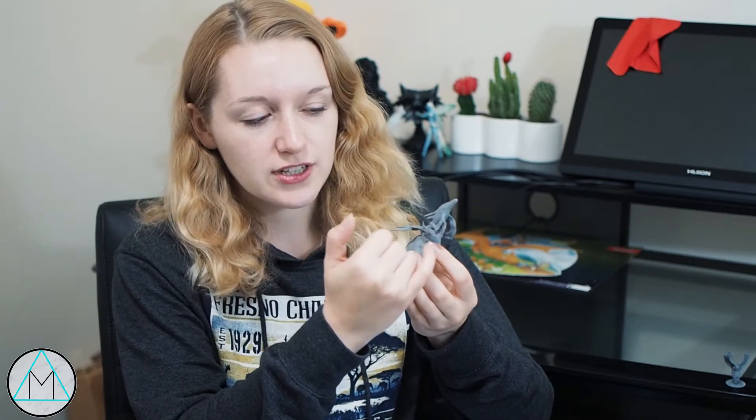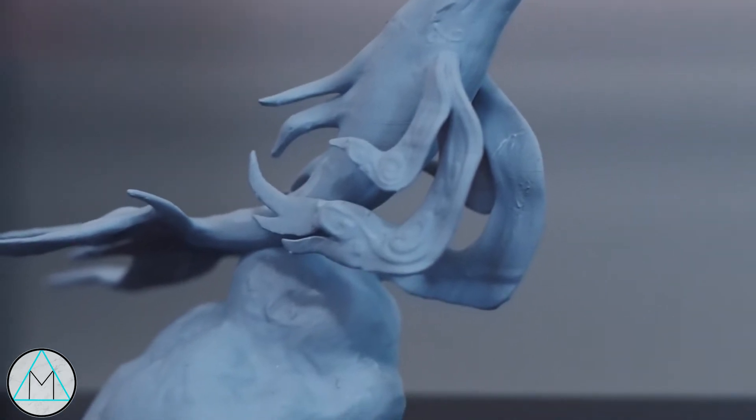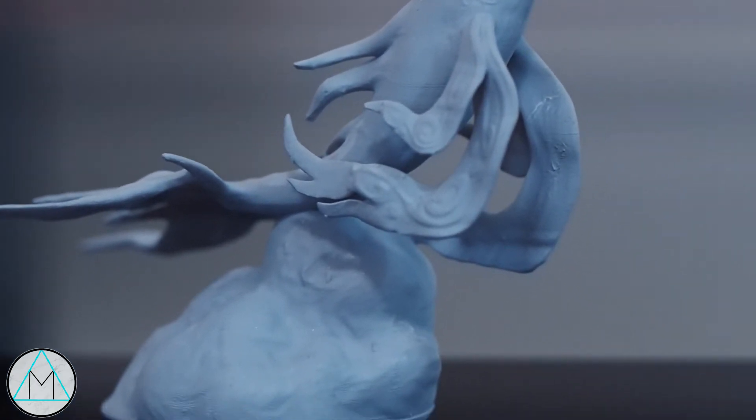It's still pretty challenging though. I try to have the ends of the wing going upwards because it conveys the design of flying and upward motion, but at the same time it's easier to 3D print. Most things I design, I consider printing with the base flat. I've printed stuff at 45 degrees before — it's just not my favorite. I usually have to sand the base and get rid of support marks. I want the base to be perfectly flat.